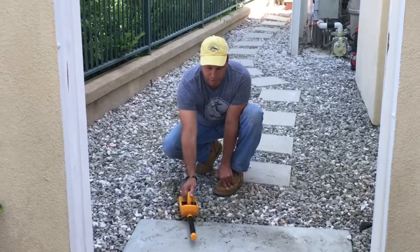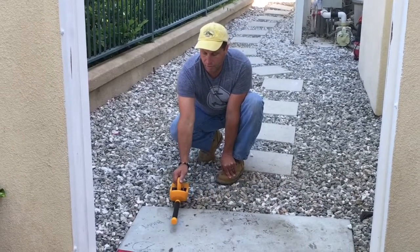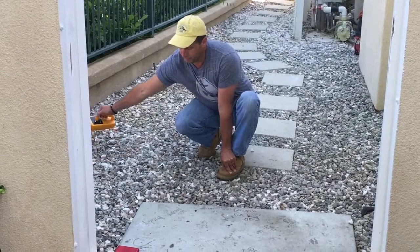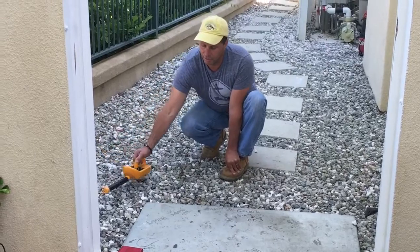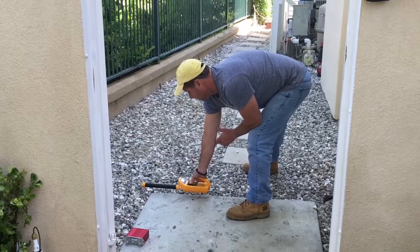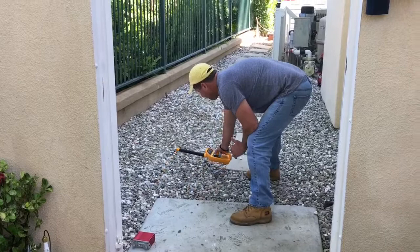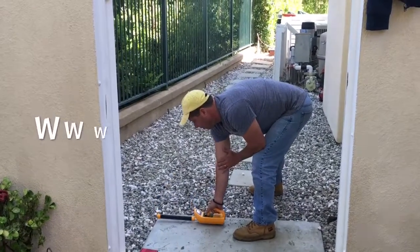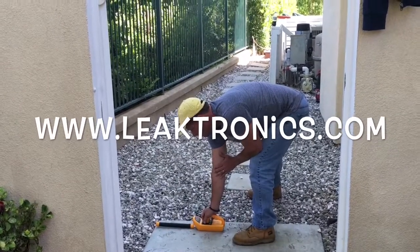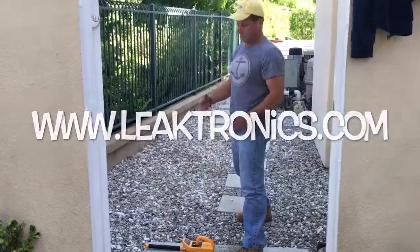This is where we're loudest. Let's go see if it's going to dim — totally dims. Pick the pulse back up here. It dims that way. So then we grid it and we go this way. Our leak is right underneath here. Put an X, cut, and do your repair.